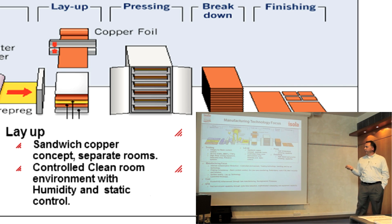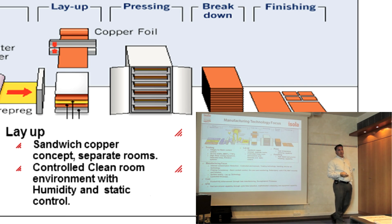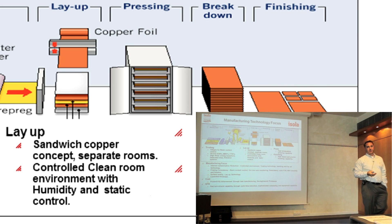We'll cure that material and it comes out as a finished sheet where we'll trim the edges. Then we'll trim into panels depending on what the fabricator asks for from a panel size, which a lot of times depends on what your part size is. Globally, 24 by 18 are probably the standard panels, but we do see large panels for back planes — we're running 24 by 54s, and 21 by 24s are becoming very standard, as well as 21 by 27, and others. It depends on what region of the world you're in, since everybody tries to pack as many parts as they can onto that panel to keep their costs down.